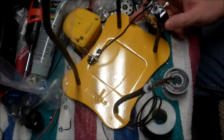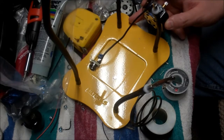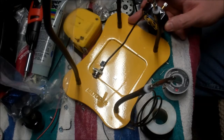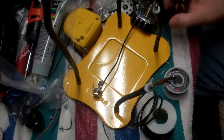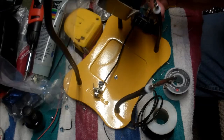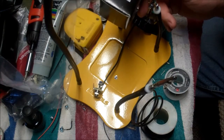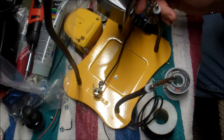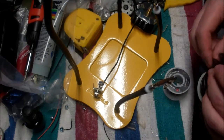And then we're doing the signal in, but we're going to want to put the bypass option on there. Okay, let me think for 2 seconds. To go in, the signal is going to go into... and see what's stupid is I could have just drawn the schematic out. Our signal is going to go into 3 and come out of 2. But I need to be able to bypass 3 to 2 in the event that we are going to be bypassing the highs for our bright switches.